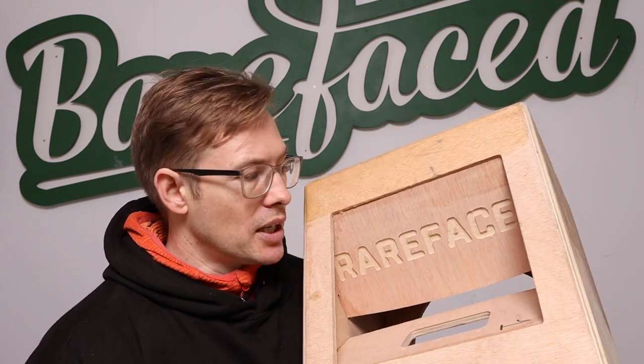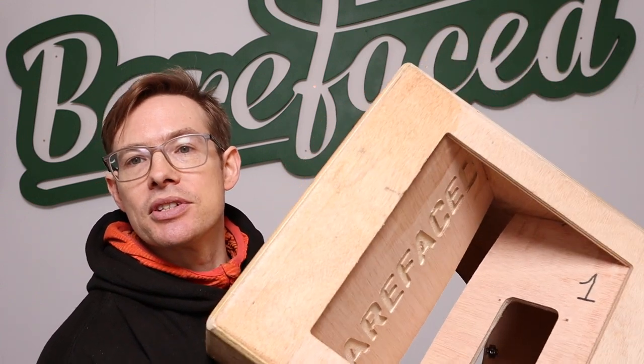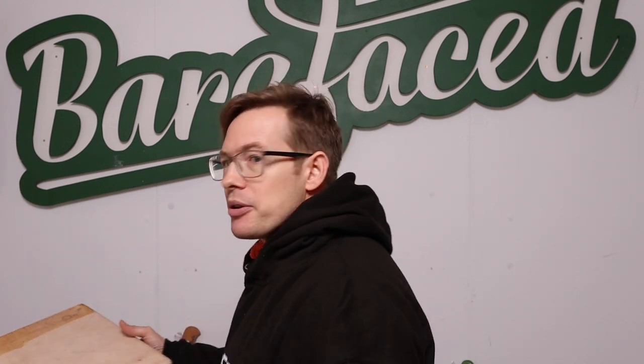This angled thing is not something you want to mess with — this is why the patent documents are quite precise about it. The challenge with subsequent cabs has been to see what happens when you scale up. We haven't scaled down; this is our smallest one at the moment, the 10-inch cab. Generally in audio it is easier to scale up than scale down, because sound waves are quite big things and air is quite squishy. So bigger stuff tends to work better in sound than small stuff, which is why all the best speakers in the world are bloody massive.